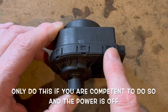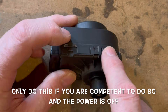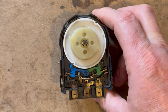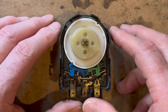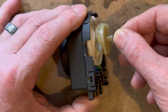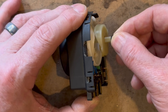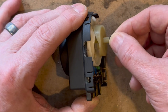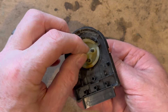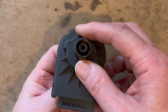Let's have a look inside. If we flick these pins out around the side we can remove the head, but be careful because they quite easily snap off and they're not really designed for taking apart. Once we take the outer cover off, this is what we're left with. If I turn it on its side you'll be able to see what happens with the pin — it rides up this cam to go in and out. The pin slides up and down in these runners so it can't come out and it can't twist round.